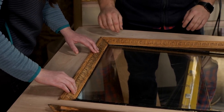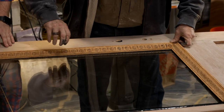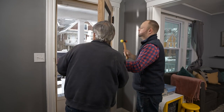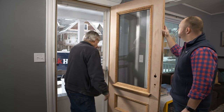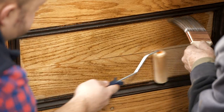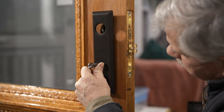I know a lot of work went into the detail on this trim, but it looks great. I mean, it's a fantastic door — it's like a brand new door. We'll get them into the opening and then nail them off. All right, let's see if it still fits — it still fits and it looks good. We've got our prime coat on, now we're ready for one of our final finish coats. We're going to roll on our first coat of urethane — this is a semi-gloss. We hung it in the opening so we can do both sides of the door at the same time, and later this evening you'll be able to close the door — you want to have a door overnight. Now I'm going to put the hardware on — this is the hardware that you picked. It's really nice, I love the look of it.